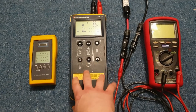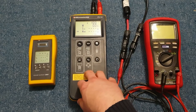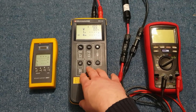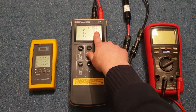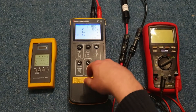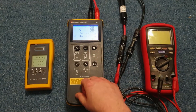Whilst this can measure insulation resistance, it will only measure insulation resistance as part of its auto test sequence, so if it doesn't detect a string it won't perform an insulation resistance test. At the moment we've got zero input voltage, so you cannot use it to perform a test, which means you cannot use it to test the insulation resistance of cables or anything that's deactivated.